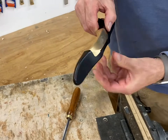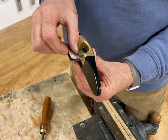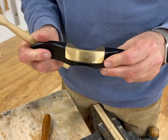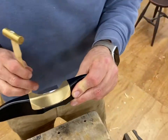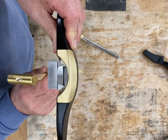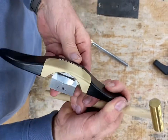I can then put that back into the tool. To do that, put your thumb over the throat, slide the blade in so that the thumb stops it coming out, and put the wedge — slide that in on top. Then just give that a little tap just to hold it in place. Look from the front over the brass nose, and then tap the back of the blade until the blade starts to come through. You want a nice even projection all the way through — one more tap, and that is then in place.